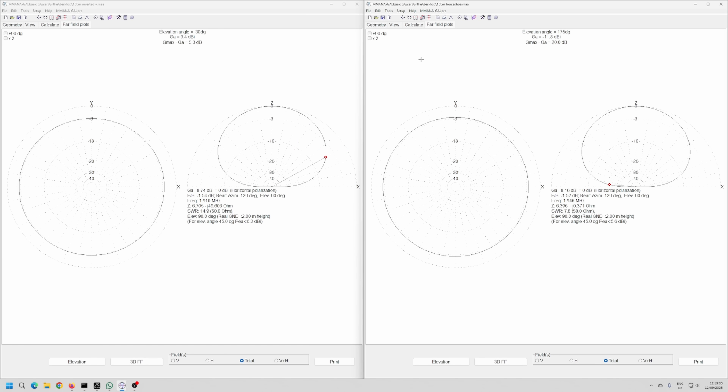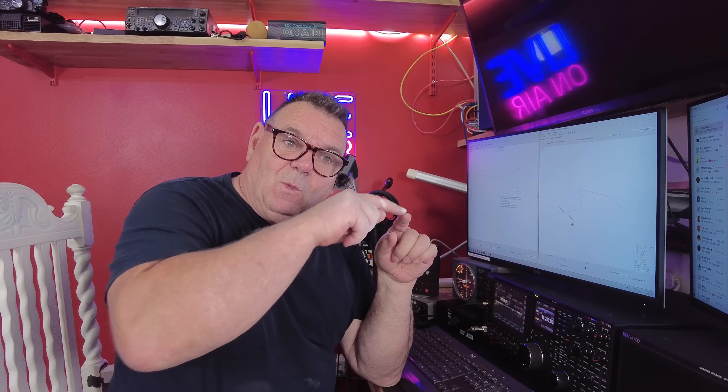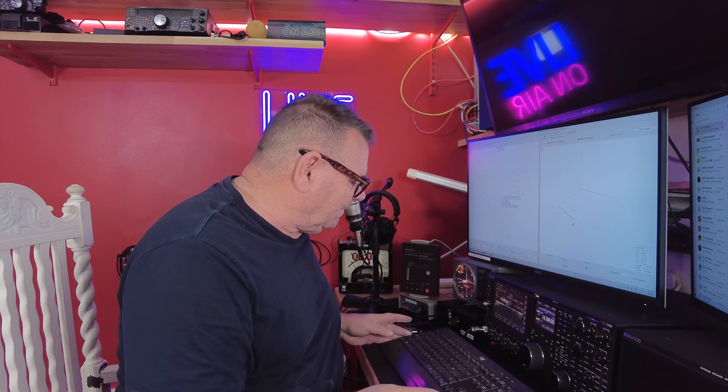There's another way of doing this. You can see the high current point is here. Instead of coming down and along in a horseshoe, if you want to do this for 40 or 80 meters, you use 12 meter legs that go out and then come back right next to it — it's a fold-back. I used to call it linear loading, but it's more of a fold-back loading. You go 12 meters one way, then come back about 10 meters, so you can really squeeze it in.